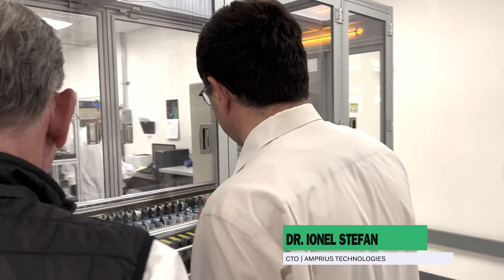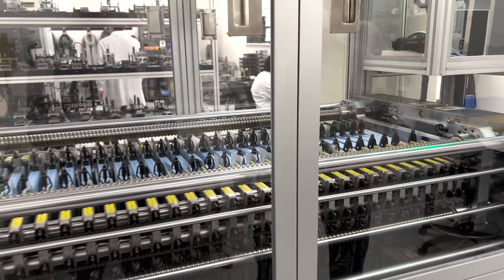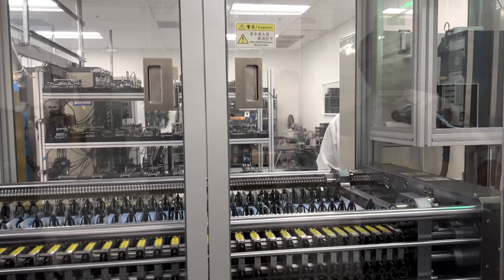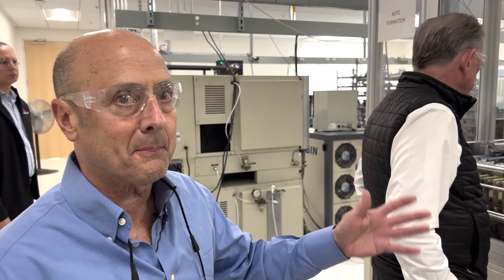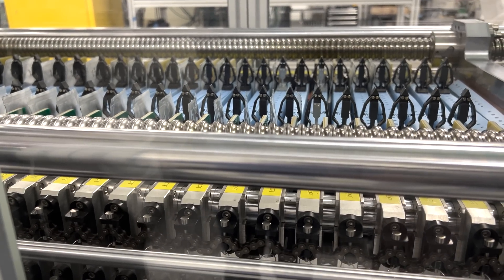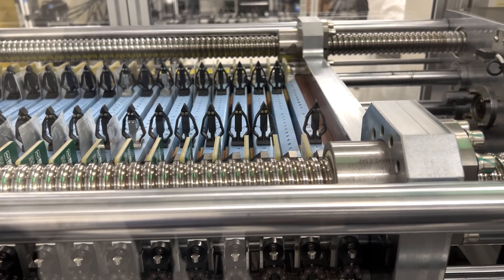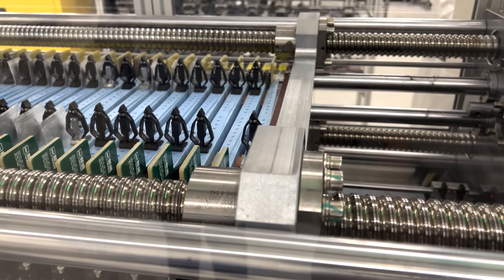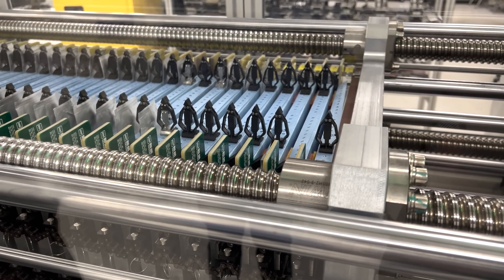The cells that we're making are loaded between a contact plate and then automatically pressed in a controlled environment. We're doing about 128 cells at a time on one machine. This is a production system — albeit a small version — used in every battery manufacturer making pouch cells in the world today. In our expanded facility we'll have many of these, and in mass production they'll be bigger. You load the cell into these slots, compression is applied, they're connected electrically, and temperature is applied. This is called formation — the first cycle of the cell — and it's very important for the properties of the cell.